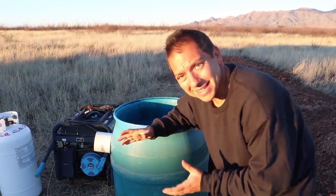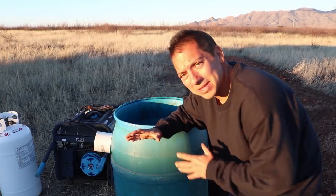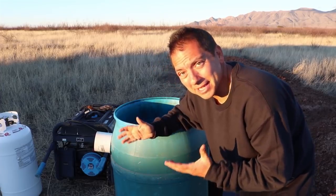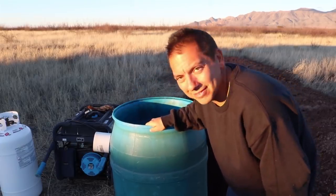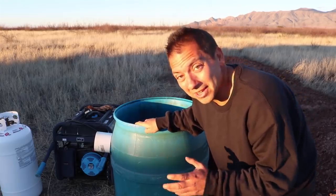One of the downsides is that I did not know how this barrel was going to be constructed. Some of the instructions I had for digging this septic, I got from the excavator, and then when I was talking to him again, it seemed like that almost changed. It probably just needs a 3-foot leach line and a 3-foot pit, because this does not even need to get buried. Part of it actually has to be sticking out above the ground. I'll get into all that a little later.